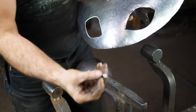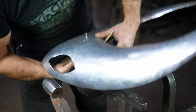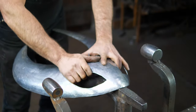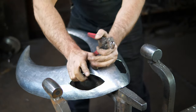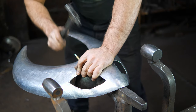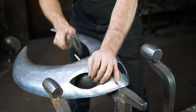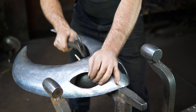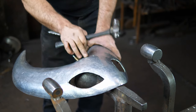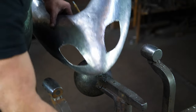I've got a flat-head aluminum rivet — three-quarter inch long, the only length I had — so I'm going to trim that down once it's through the hole. Putting the rivet head on the inside, I want to bottom the rivet out against the ball and then snip it off close to the base. Working with aluminum it's so soft you can get away with a lot of stuff you couldn't dream of with steel, but the trade-off is something too soft for use and abuse — it'll work fine for this mask though. I've closed up the rivet and peened it over, countersunk the hole slightly so the rivet has somewhere to go. The rivets won't be invisible but they'll blend somewhat with the overall surface texture.